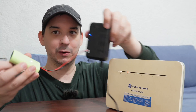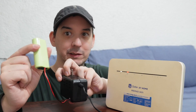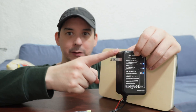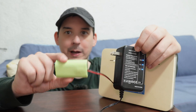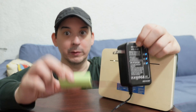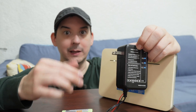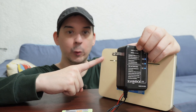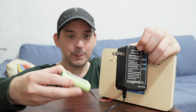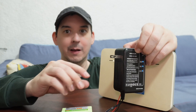That's a really nice feature — the fact that you can expand capacity like that. This is only two batteries; you could buy much bigger external batteries. One thing to consider is that when the power comes back, it's going to be charging the internal battery, the external battery, and also powering the router, so it's not the fastest at recharging. I measured anywhere between 5 and 10 watts — it fluctuates depending on load, temperature, and the size of your external battery.